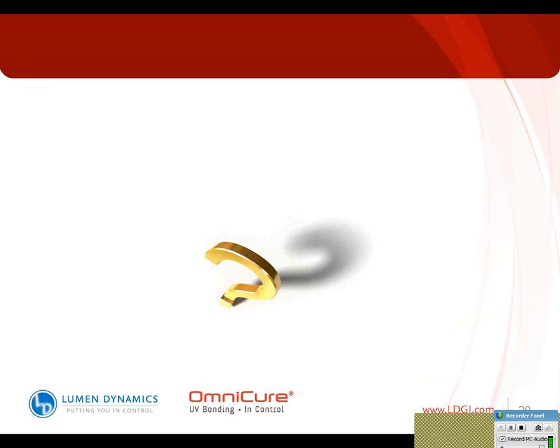Well, it's a good question, and it's one that does come up time and again. If there's a manual UV curing system that is being used, it's also going to depend on the degradation of that particular lamp, because every lamp will degrade differently. Also, even the same lamp modules, a lot of times these lamp modules are handmade. It's fairly common from the large manufacturers because of the special nature of these particular lamps themselves and the focus that's required. That'll range anywhere from maybe once every 4 hours to at least once a shift.